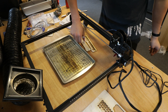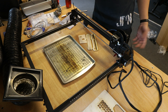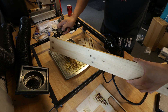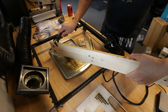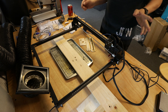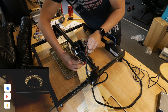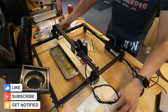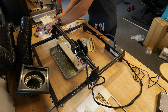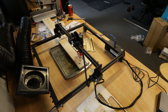Three millimeter plywood is no problem. This one obviously isn't even plywood — it's birch, a very thin piece — but let's move on to the wood I use the most. This is reclaimed wood from my pallet, so there is no glue between the layers and this is about 14 mm thick. It will be a good test to judge the power level of this machine at half the power of the X20 Pro, so it may not cut through. I'll just quickly cut this piece down. Let's start.